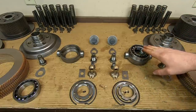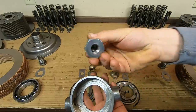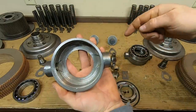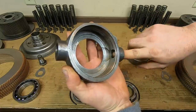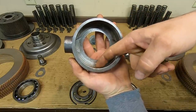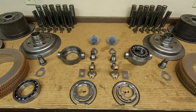One other interesting thing with these cages: we have this oil feed system that comes in through these hollow bolts. You'll notice the cut-out pockets on each side — the oil runs through that bolt and comes in behind the outer race, gets into that pocket, rolls down into the closed-off portion, eventually accumulates, and runs into the bearing. The bearing will circulate it throughout itself. Pretty simple how that lube system works.